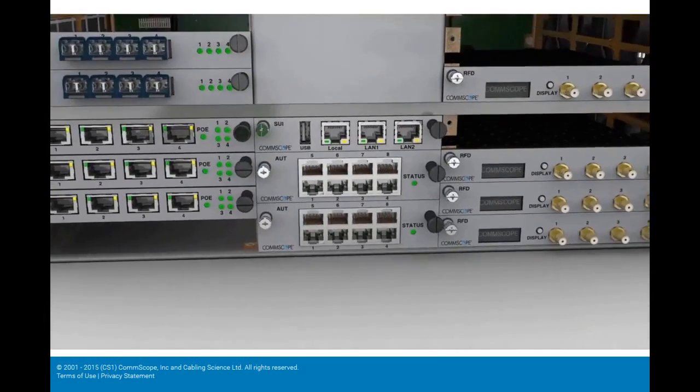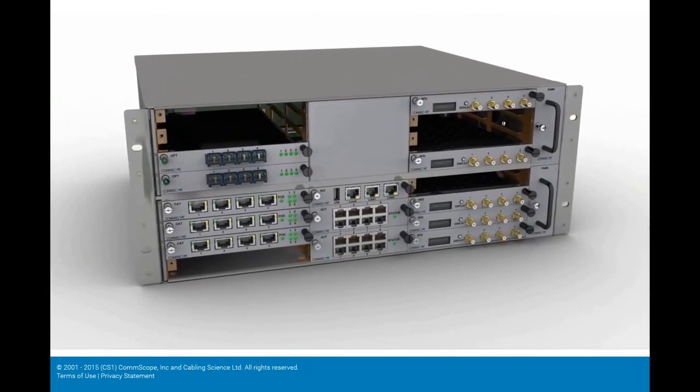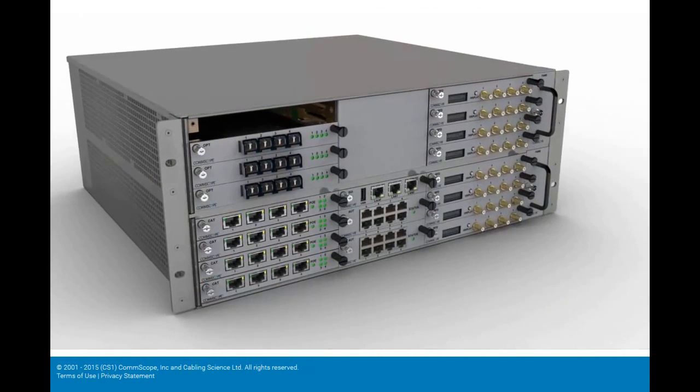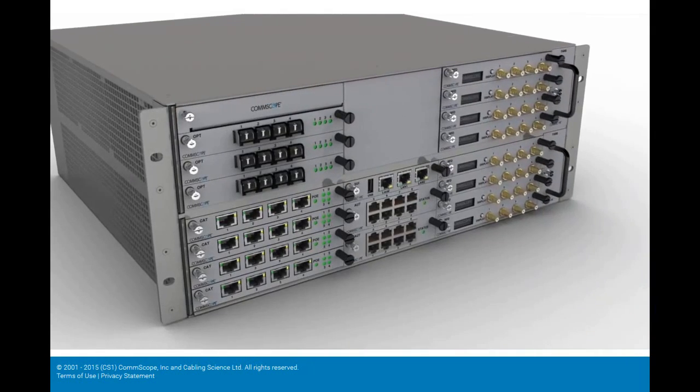The WCS is flexible and upgradable. Additional cards can be added to the WCS by filling unused slots or adding additional WCS subracks to handle future growth. All open WCS subrack slots must be filled with blank panels to optimize airflow.